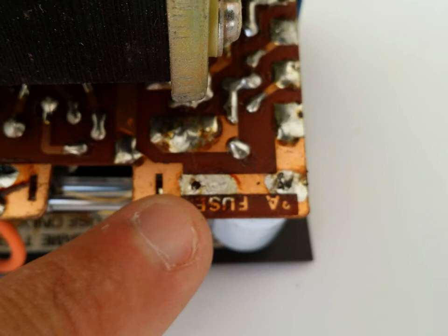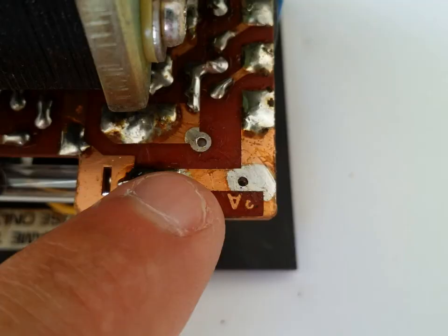You're going to need to do this in three places. Remove some screws from the bottom of the unit and slightly move the board up out of position so you can access those contacts to re-solder the new capacitors in. The biggest problem with this particular power supply is that it would work, but the capacitors were extremely dried out. I'd get the 12–13 volts I needed, and then all of a sudden it would drop to 6 volts — that means the capacitors can't maintain voltage. That's why you need to replace the capacitors in this VR2 power supply for the VTC7100. Replace them so you have steady power to the machine when the restoration is complete.